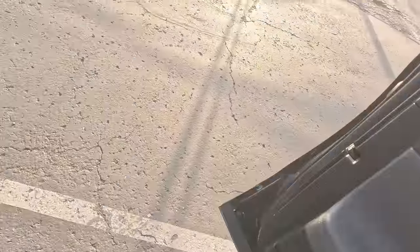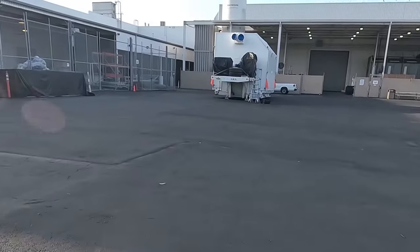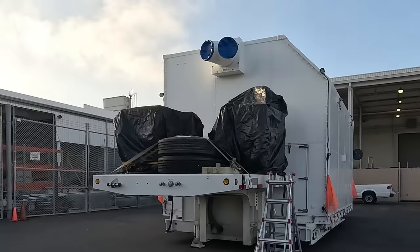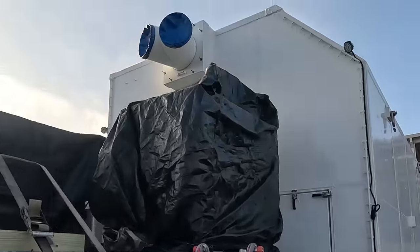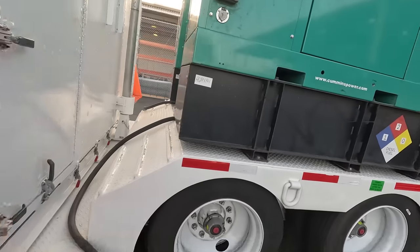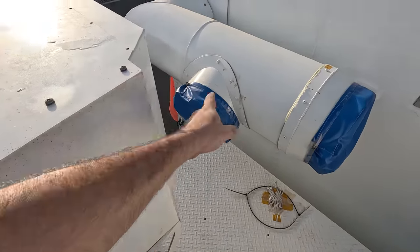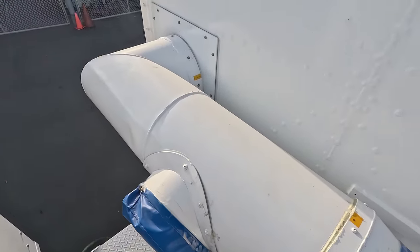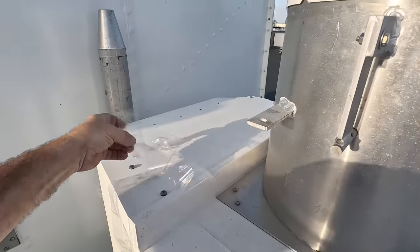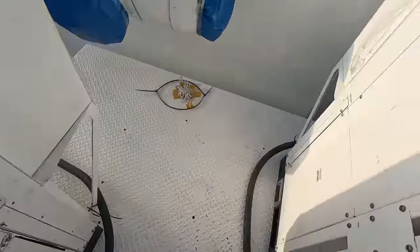So we've got the tools over here. Let's go ahead and get this thing prepped up and ready to go. The heating and cooling units are underneath the tarp. One of the duct connections came off. This big cable goes underneath the trailer here and then goes over to the generators back here. This obviously connects to those there, and the returns here — which probably wasn't the greatest return design. There's no scoop in there, but the people that built this weren't HVAC guys.